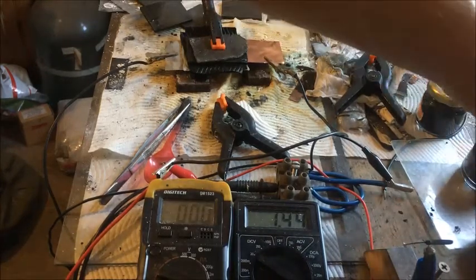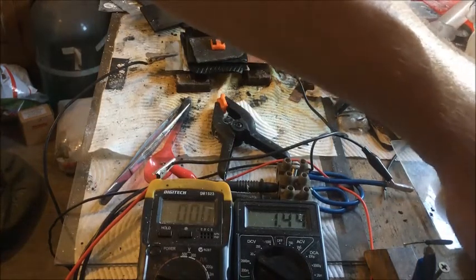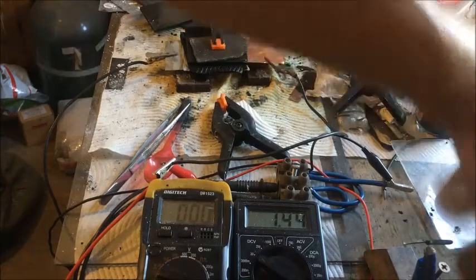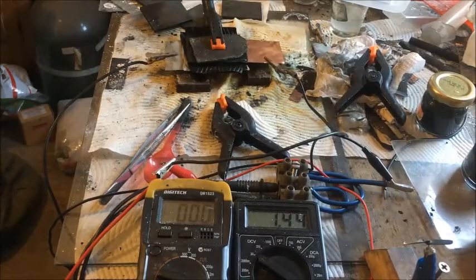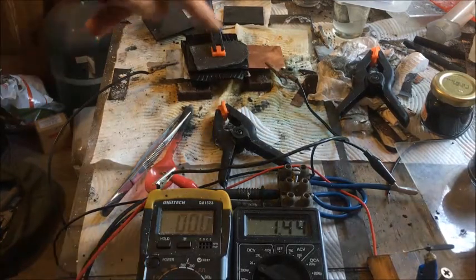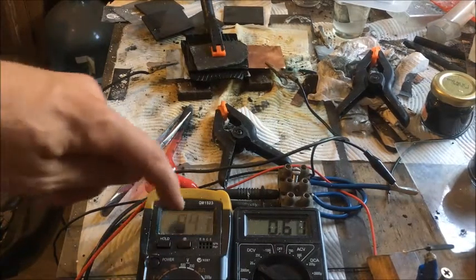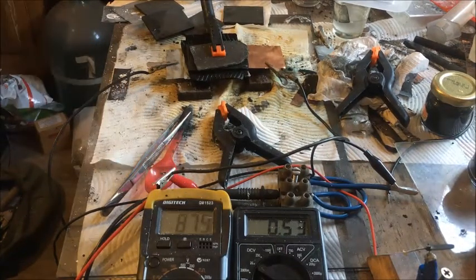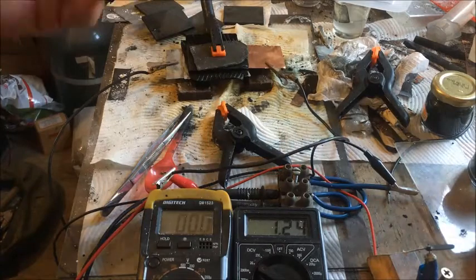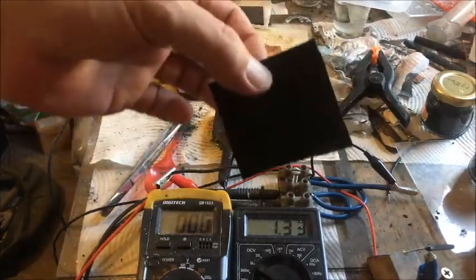I don't know how many experiments we're going to get on it. For a short circuit on the newly fabricated cell with the separator in between, we're at 97mA — it's looking okay. Maybe it needs that separator. The carbons measured 700 ohms resistance for the manganese dioxide one. That dropped us off a few volts.